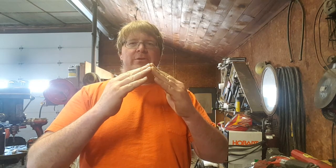So I asked him the other day for a good tap set, and he said they don't make a good tap set. You buy taps as you need them. Then you buy a pilot bit, the proper drill bit for that tap, and you keep it with that tap. You don't hand resharpen that drill bit, because if you hand sharpen it, maybe you got it off center, and now it's overbore. You don't want a dull drill bit that's going to wander and create an oversized hole.